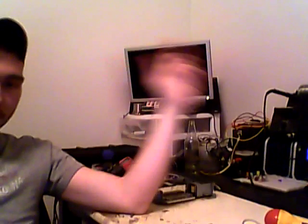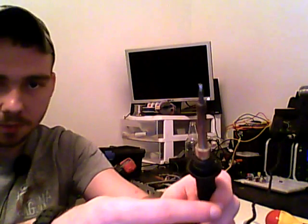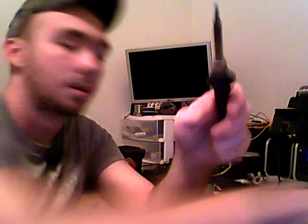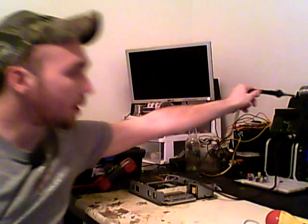Some of the tools you're going to need to obtain those parts is going to be a soldering iron, of course. I have a station set up that I use just for desoldering, and that's right there. I got a special tip for it — it's a chisel tip, a square tip, so you get the maximum amount of heat to whatever you're trying to desolder.